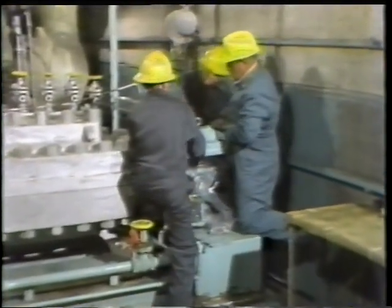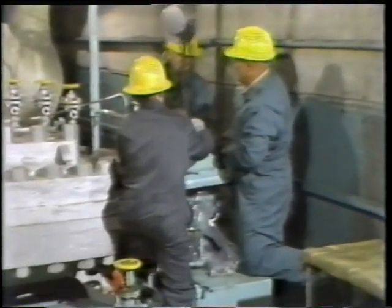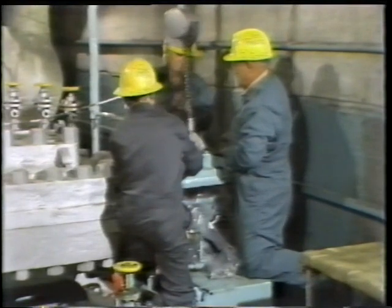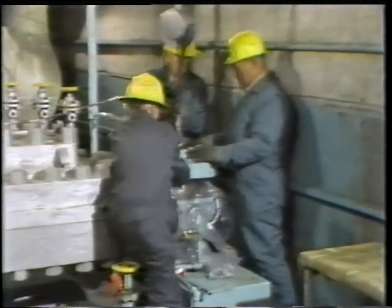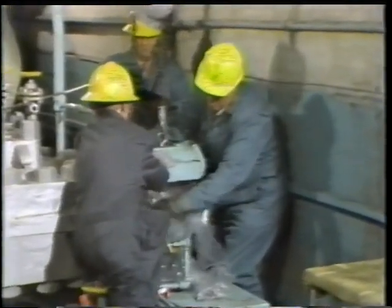While handling the chain hoist and upper housing, it's possible that grit or paint chips could fall into the lower housing and cause bearing failure. So a cover is a good thing to use. It could save a lot of unnecessary trouble. With the upper housing suspended from the hoist, the cover is taken out of the way.